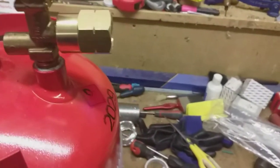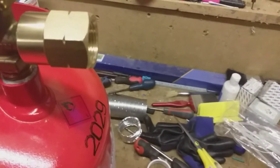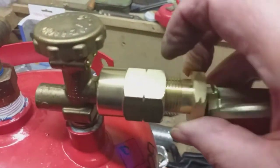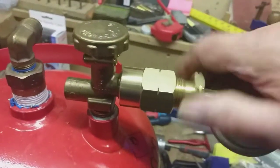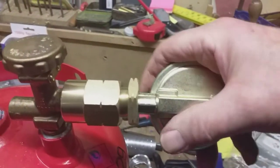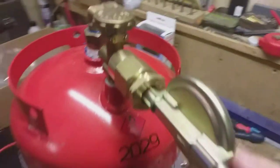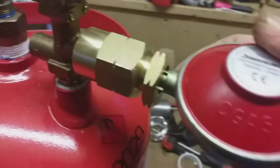It should be okay because it's got a rubber in the end. I'm putting this one in again - it's a left-hand thread - and I'm not going to put any PTFE tape on because this is all done properly by the two faces really mating together, making it gas-proof. Okay, it's about right.